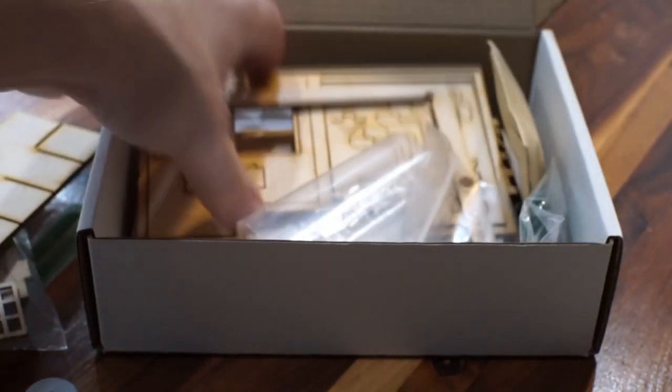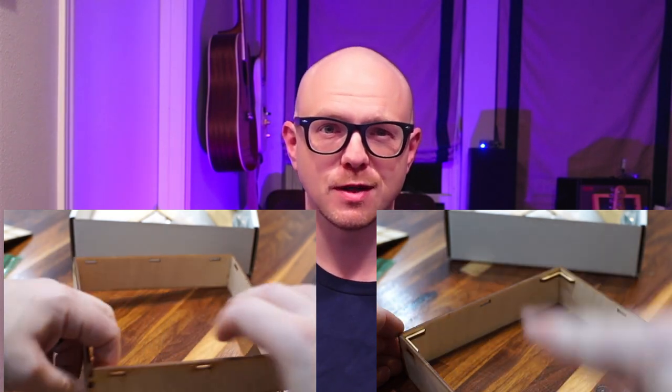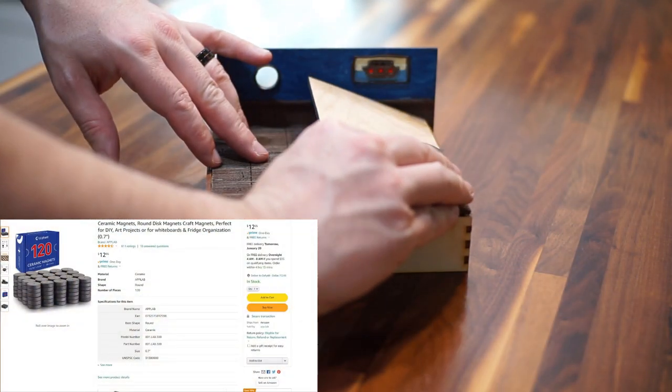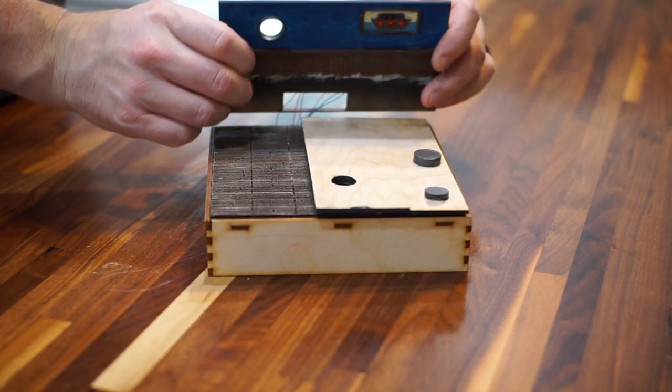In this video we'll talk about how to assemble the hardware and how to create puzzles. In the box you'll find four walls, braces, a foam floor, and some wall frames. Walls are assembled with hot glue and a right angle should be used to ensure it's all square. The foam floor should have black mod podge on both sides, and velcro attached in places you want to sense the position of items and players. I sometimes use velcro strips so the sensors can be relocated easily between games. The walls use large 18mm diameter magnets to hold them flat — two glued to the back and two more glued within the frame — allowing the walls to be taken down for packing.